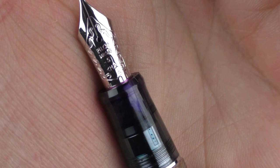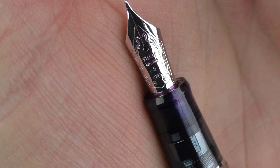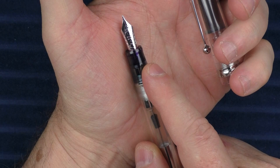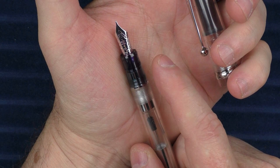24 karat gold is pure gold, which is too soft to be used for a nib. So the gold needs to be mixed with other metals like copper, zinc, silver, or nickel. 14 karat means that 14 parts out of 24 are pure gold, which breaks down to 58.3%. But the number here says 585, meaning this nib has 585 out of 1000 parts gold. Some manufacturers produce their 14 karat gold slightly more pure and prefer to call it 585. So 583 and 585 gold are basically the very same.